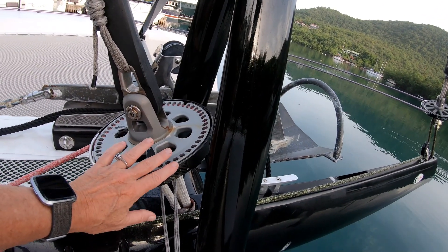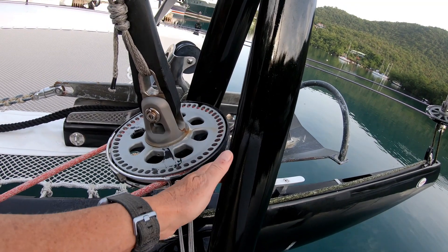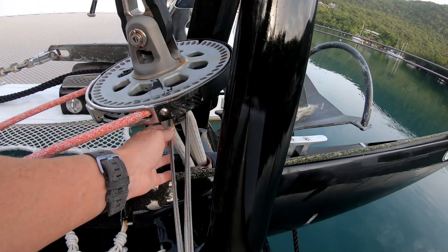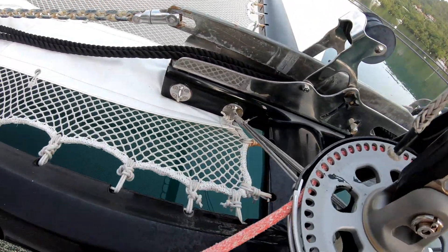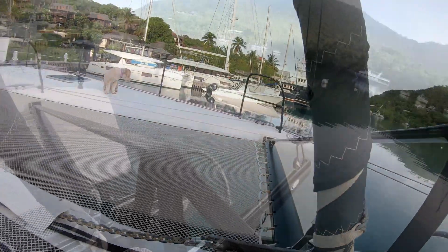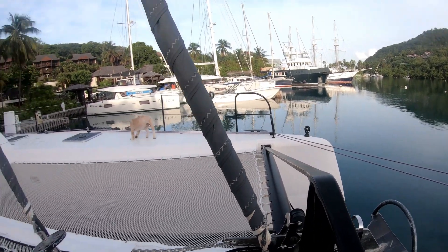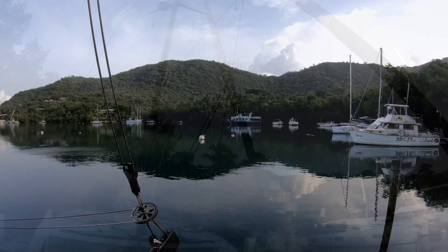There's a lot of pressure on this roller when we're sailing and it would hit the carbon bar right here. When they opened it up they could see that not only was the putty casing damaged, but the carbon fiber itself. That was repaired, and now Pierre has put these Dyneema strands right here and on both sides to prevent it from hitting this carbon fiber beam — which is an important structural component because if it were to fail it could bring down the mast.